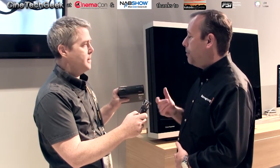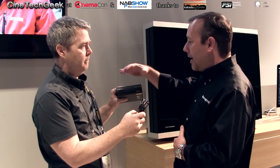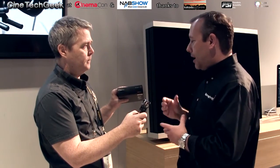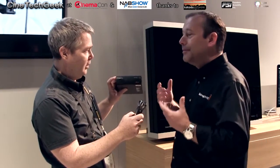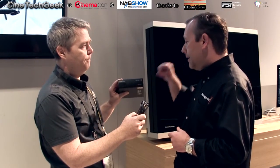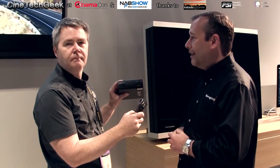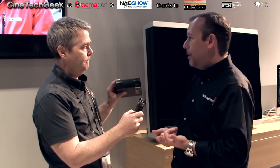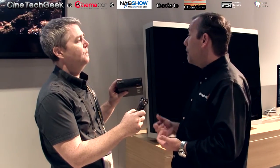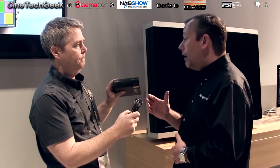What you're holding is an IP Video 12G converter. For anybody that knows our product range, it's in the same enclosure design as the Teranex Minis — designed to be used standalone, or you can put three of these into a rack shelf. They can have a smart panel with a screen and direct controls on the front. If you want to turn SDI into IP, that's your box — whether over gigabit Ethernet over copper, or over 10 gig fibre, for moving SD, HD, and Ultra HD over IP.